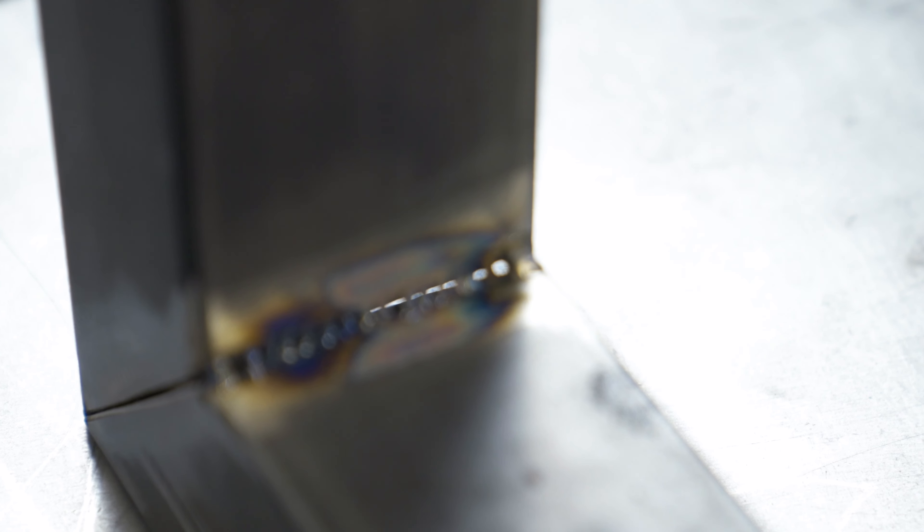The main idea behind this is you're essentially making little teeth all the way across the gap. You just get a little bit of a bead started — preferably at the bottom, as that seems easier — and then melt the top and bridge them together. You want almost as little filler as possible, but as the little bridges come together, you're jumping over the gap and making another one, trying to space out every other bead when you actually weld. You can see that while welding it kind of wants to pull away, which is the problem when you just weld this straight. As the material gets hotter it's going to flow in more, so this gives you some support as you run your final bead across. I'm having a hard time staying consistent — you want to keep these about the same spacing and size, but I'm kind of reaching around my camera here, which makes it a little tougher.